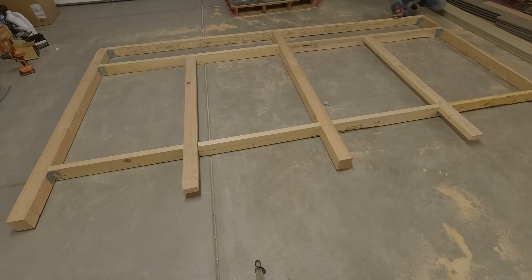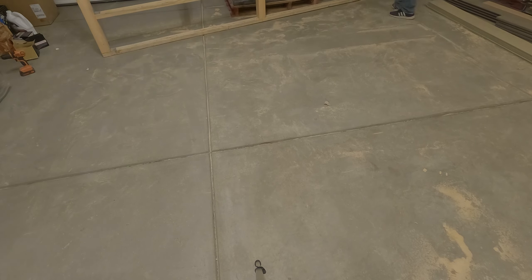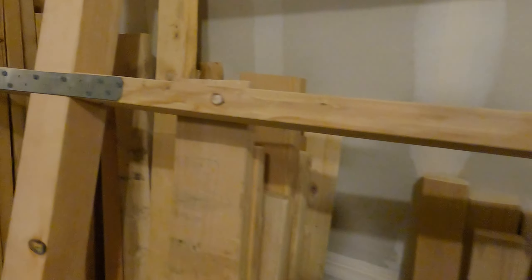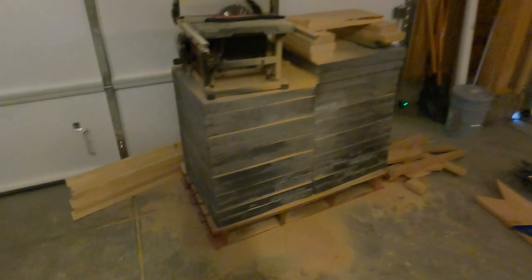Since this is not finished wood material, I did go and sand down any rough edges using an electric sander to make things nice and smooth. Now it's time to make the side boards. I measured the distance between each post, which is around 3 feet, and I prep cut a lot of 2x4s to match this size. But since 2x4s are too thick — actually an inch and a half by 3 and a half inch — I cut them in half and in half again, making 1 and a half by 3 quarters inch. This can be easily done with a table saw.